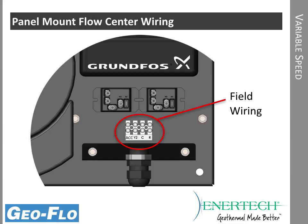This is the field wiring. You can see here there's terminal ACC that comes from the accessory terminal of the heat pump. Y2 is second stage, common, and 24 volts. So these are the only connections needed from the heat pump to the flow center on the low voltage side. And the isolation relays are factory installed. All the wiring between the controller, the relays, the terminals, and the variable speed pump is done at the factory.